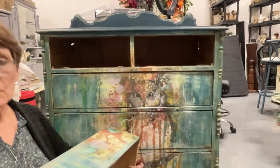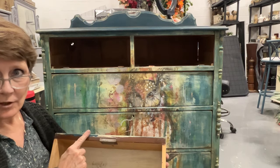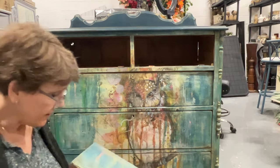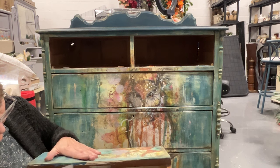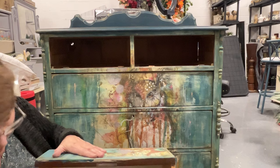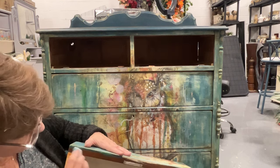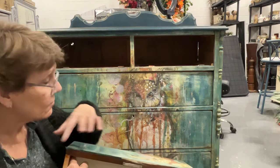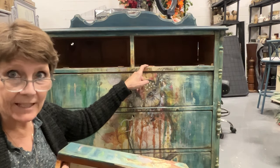Part of the beauty of using DIY paint — and because we used so much water, it's messy — you're going to get paint that has seeped onto the edges. But it's reactivated with water because we sealed the front but didn't seal the top and sides. So I'm able to take my putty knife and scrape off big amounts, then just take a wet towel, wet rags, baby wipes, whatever you've got, and just wipe away and clean it up. I do that to the outside of the drawers and then to the inside rims as well, so there's no problem with them sliding easily in future.